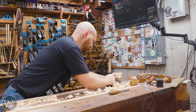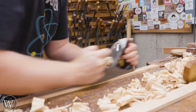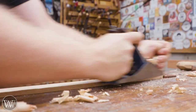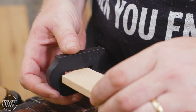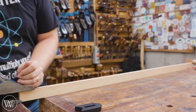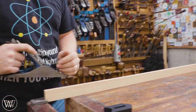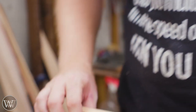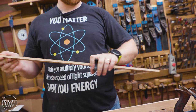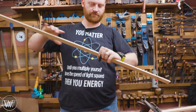You'll notice it's popping up — that's one of the problems with long, thin pieces. Sometimes I'll put a piece of double-sided tape underneath to hold it in the middle. And sometimes the grain switches, so you have to come at it from the other side. We just want to plane these down to the appropriate thickness to fit into the small pieces we want to work with. Now we've got them to the right thickness, so they need to be to the right height as well — these are a little over an eighth inch too tall, so we're going to plane them together until it slides all the way down.